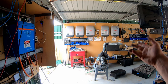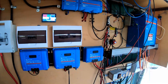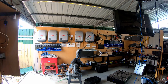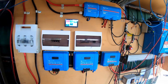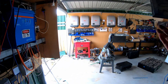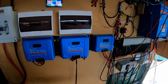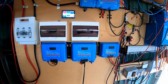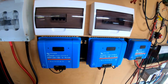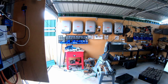I can lose three kilowatts somewhere but still have more inverters; I can lose a DC solution and still have another one or a backup. The criticisms of the AC coupled solution aren't valid — it's just keyboard warriors putting their opinions out there. This is our solution and we're happy with it. As long as I can pick up these things cheap, as soon as I add another inverter I'll buy more of those — $250 a piece. I'm happy that this can restart the system; if there's no AC signal they won't start up, but these two are enough to get the system going again. And given that this has a 140-amp inverter charger in it, why not?